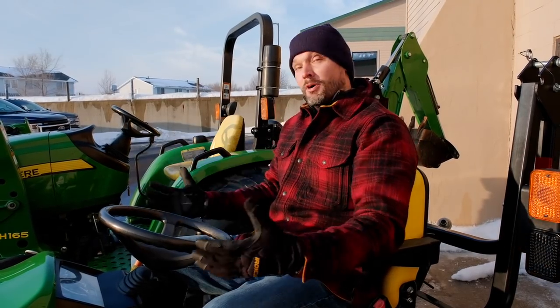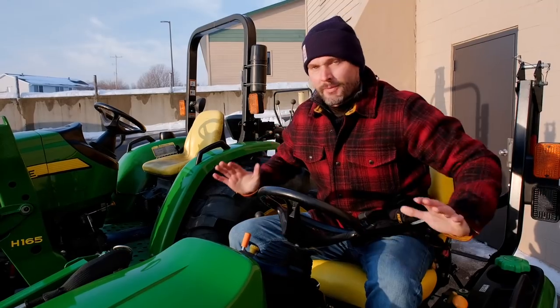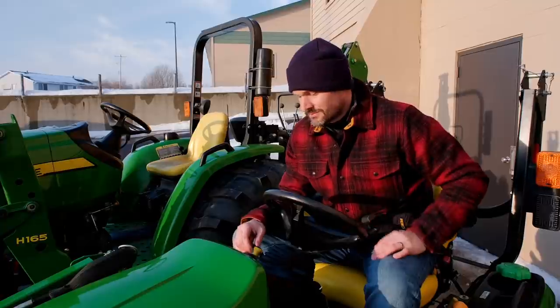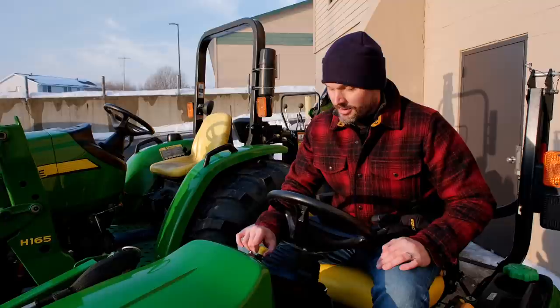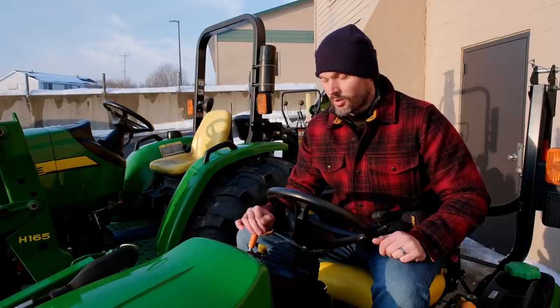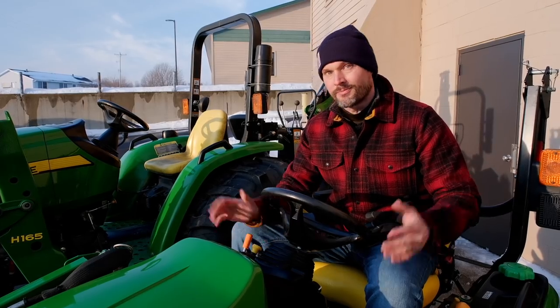The second way is actually built into your tractor — it's tied into the button or knob that turns your PTO on and off. For me personally, I don't find it to be a big deal at all. What you can do is turn your mower deck or snowblower on — pull up to the on position, notice it's got a little give in there, and that is a built-in override. If you pull up on this before you hit the reverse pedal, then press the reverse pedal, you can let go and it's not going to kill the snowblower as you back up. You go forward just like normal. If you hit reverse again, it's going to kill the machine — so every time you back up, just pull up a little before you hit reverse.